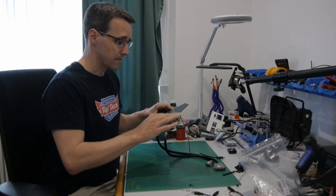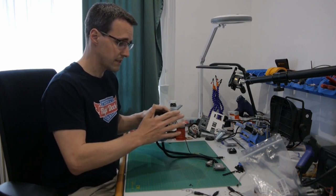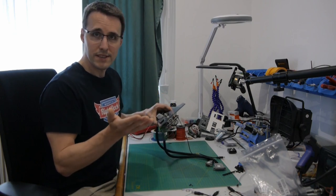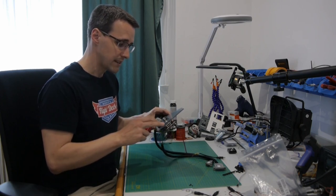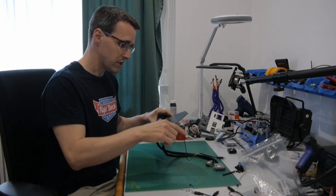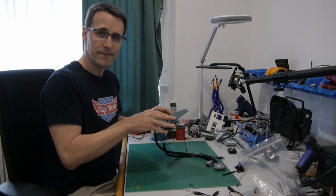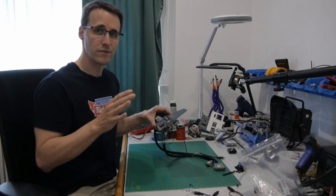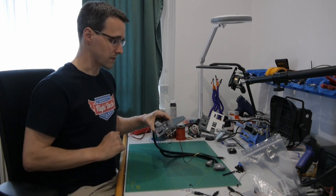To make this polystyrol stay flat on the acrylic here, you have seen I have glued this on with epoxy glue, and I have cut out a special template so that I can bring the pressure onto the whole area here. And this is important so that the plate really sticks flat to the acrylic here.